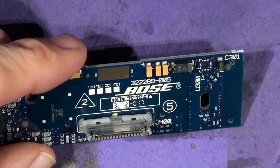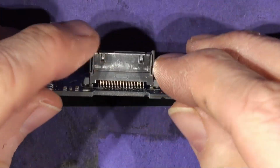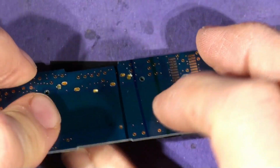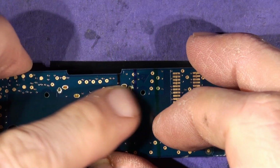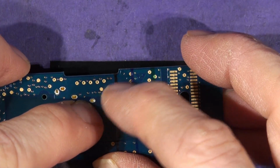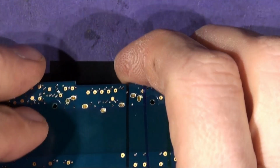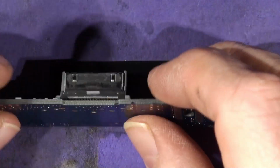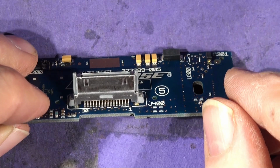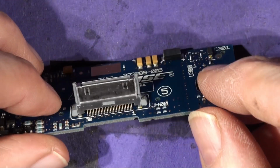People, eh? Engineers especially. So here it is, the old 30 pin, the 7 point mount one with the mount around the back, and you can see this is a Bose unit, and Bose have attached this using a surface mount soldering process. They're not even hand soldered, so the soldering on some of them is pretty icky. On most of them, if you pull them, they'll just come off, but you don't want to do that because you'll rip all these tracks off. So you do have to exercise a modicum of self-control, boys, or girls, when you're doing this. I'll show you how to go about it.